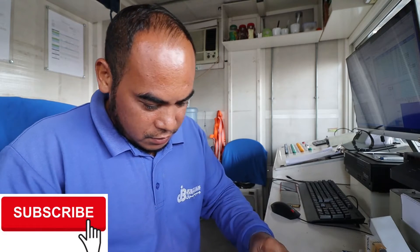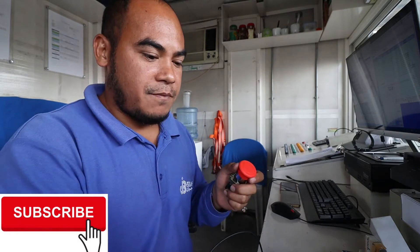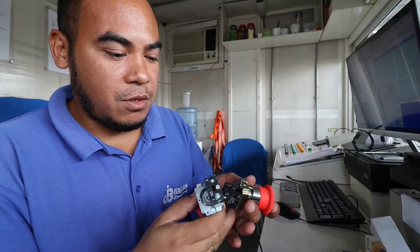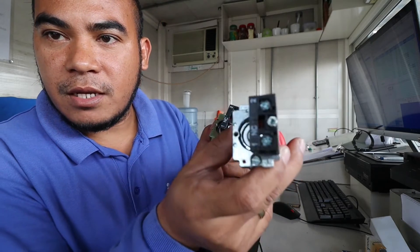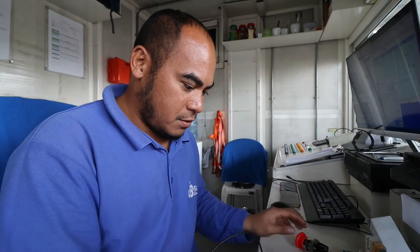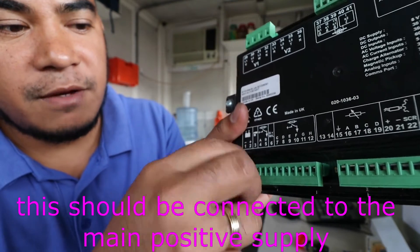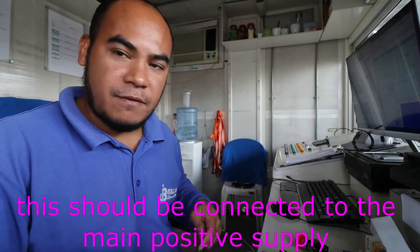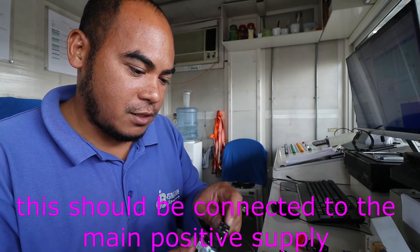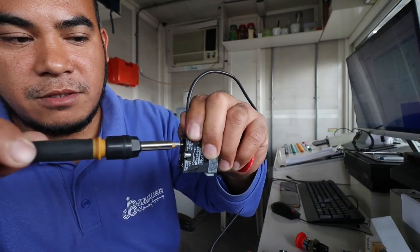We have the positive supply. I have here two emergency stops — one for the panel and one for the canopy. Both are normally closed. As you can see, both have the NC marking. I connect from the positive here, joining the connections to positive. For troubleshooting, you just need to check for positive supply — either 24V or 12V DC — and insert the wire into the connection.